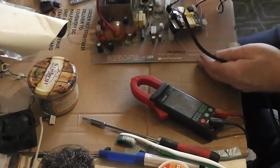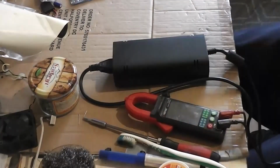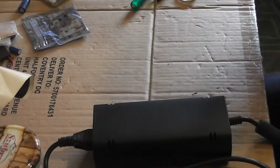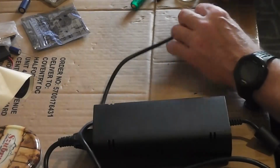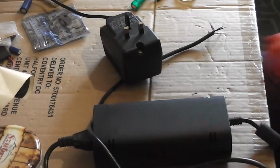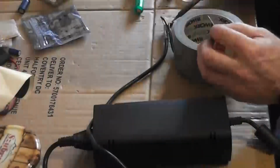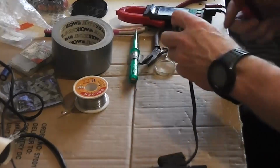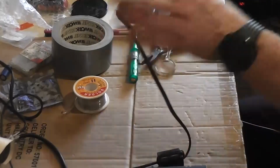Okay. Get him out of the way for the time being. Here's our Xbox power supply. Just have to read, and I have to connect the red and the blue. That switches on the power supply, and then the black and the yellow are my outputs. So black and blue and yellow is connected. Something heavy on this. Yeah, the remains of my Amiga zip drive. So power is on. We are recording, yeah. Now, negative and internal positive. 12.24, so we have our power supply.